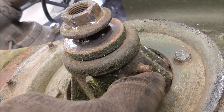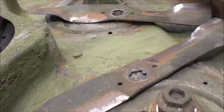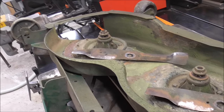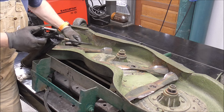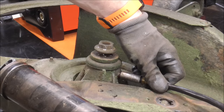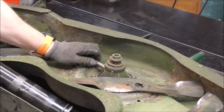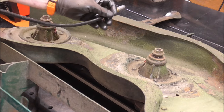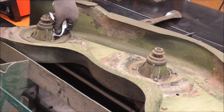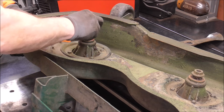The next thing I'm going to do is try to grease these spindles — put a little grease in there. This one has a grease fitting and I can't see that this one has one, so maybe this is the one I already replaced. I know I replaced one of them. After we get them greased we'll get the blades back on, and I'm going to fluid film underneath this deck. Then we'll flip it over and do all our welding repairs. I'll put a few pumps in it and move on to the next one.